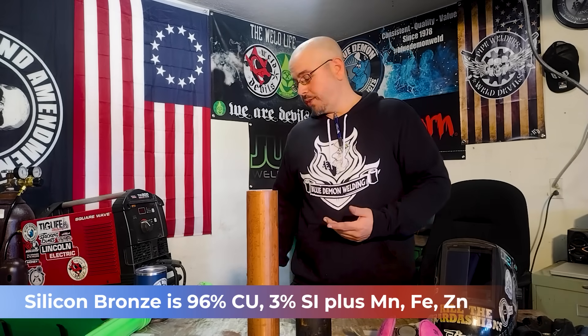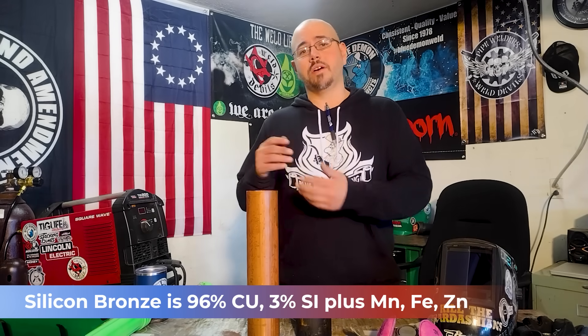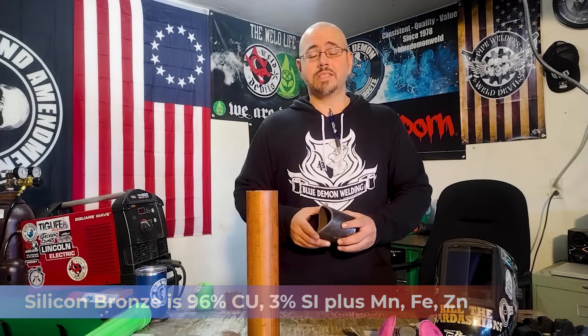What is silicon bronze and why do I use it as the filler metal to join copper and steel? It's very simple. Silicon bronze is a low-lead brass alloy that is generally composed of about 96% copper, so it's safe to say it's copper-based. It has about 3% silicon, which really helps neutralize the zinc components of the copper. Whatever is left is a variety of other alloys like manganese, iron, and zinc — all of which are also contained in carbon steel. So it kind of makes it the perfect and correct thing to use to join these two materials together.